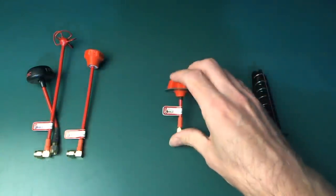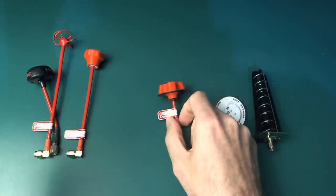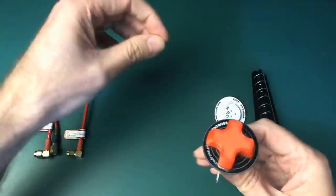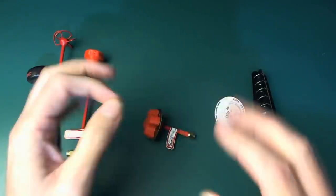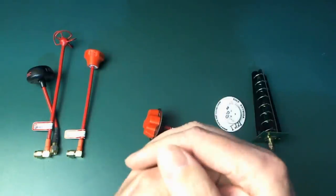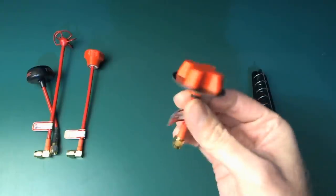That narrowness isn't necessarily a bad thing because it means it's a more narrow gain and you could go further away with it — there are compromises all over the place with this stuff. The other thing you can't tell by looking at the video is which antenna I felt inclined to use for the rest of the flight. I was flying Home Slice 4, which can fly for quite a long time, and I had a good half hour left in the tank after doing this test. I found myself reaching for this one — and the main reason was the kind of flying I do and the location relative to myself. I'm only going to be flying in one direction because I'm on the corner of the property and I can't fly over the neighbor's farm. I'm almost always flying 400 to 600 meters away, so for that medium range mostly in one direction, this one seemed to be the best fit.